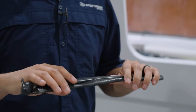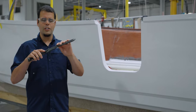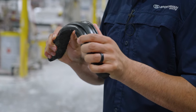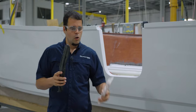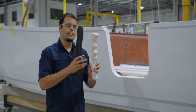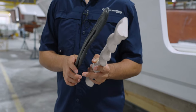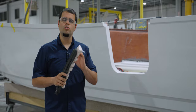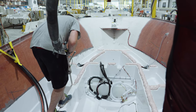The moment we've all been waiting for has finally arrived — it's time to cap the boat. The capping process begins with removing all debris from the hull and deck, paying close attention that all mating surfaces are clean and ready for a strong bond. The technician will apply a two-to-three-inch bead of bonding putty — very similar to the putty we saw in the hull lamination episode. This bonding putty is super strong, doesn't have a ton of flex, provides tons of support wherever applied, and can be built up to different heights depending on the application. In contrast, methyl methacrylate — used to bond stringers to hulls and boxes to decks — feels almost like rubber and is flexible, able to absorb energy.